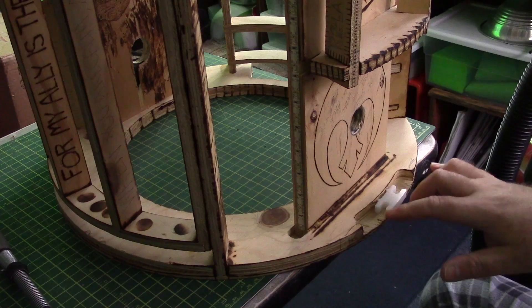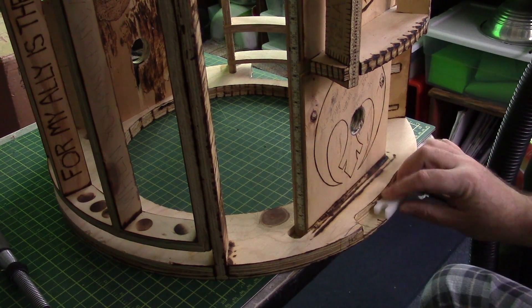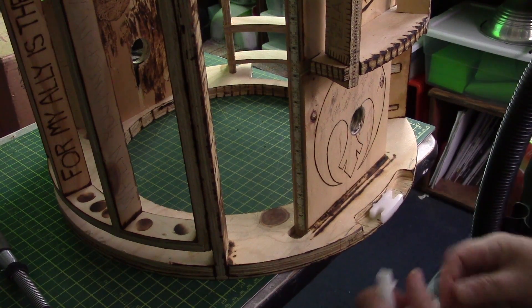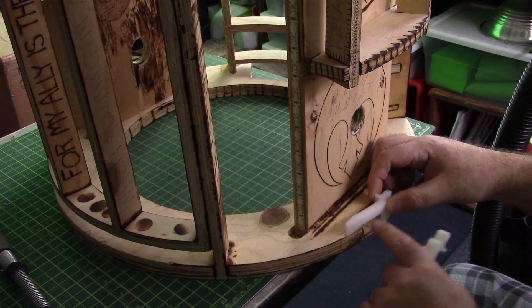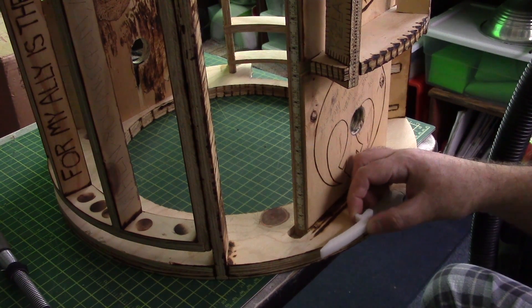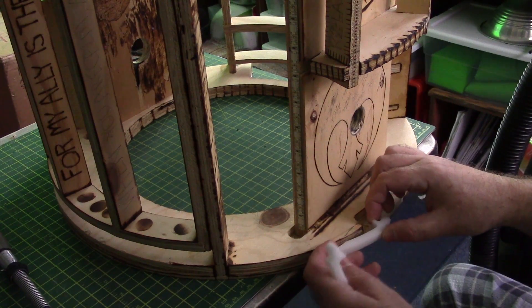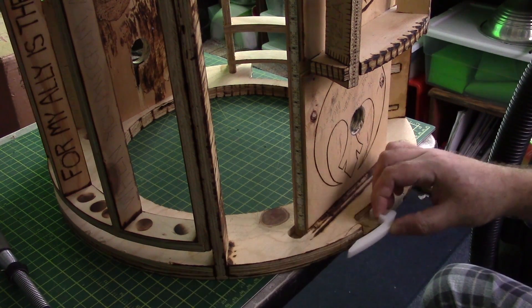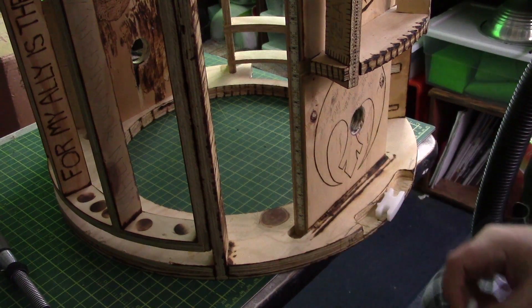There are modifications that need to be done to the frame first, and that is what is about to happen. With the snap roughly in the middle, not only does the amount of wood that the snap takes up have to be removed, but also the travel distance. Theoretically this flange here will be clear by the time you get the skin out that far, otherwise a lot more material has to be taken out.